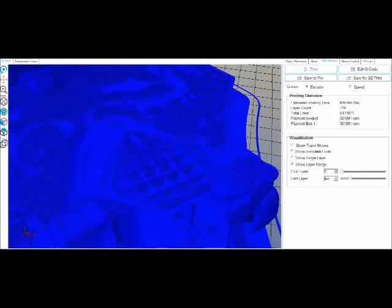The printer was still running, but the beeping was driving me crazy. I needed to find a point where I could stop the print and have a reference without having to break out calipers. So I grabbed Repetier, opened it up, and started looking at the layers to find a reference point. I found it at layer 143, where it finishes the little mountaintop shape. On the next layer, it would print the southeast portion and then do a really long travel move, so the plan was to stop during that travel move.